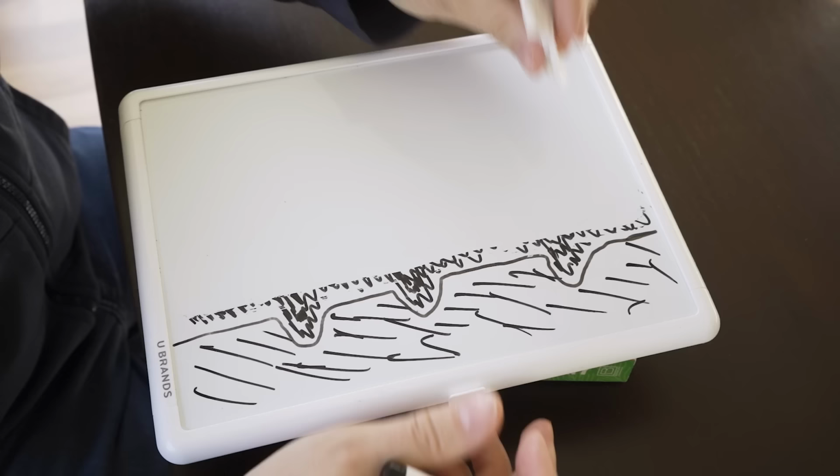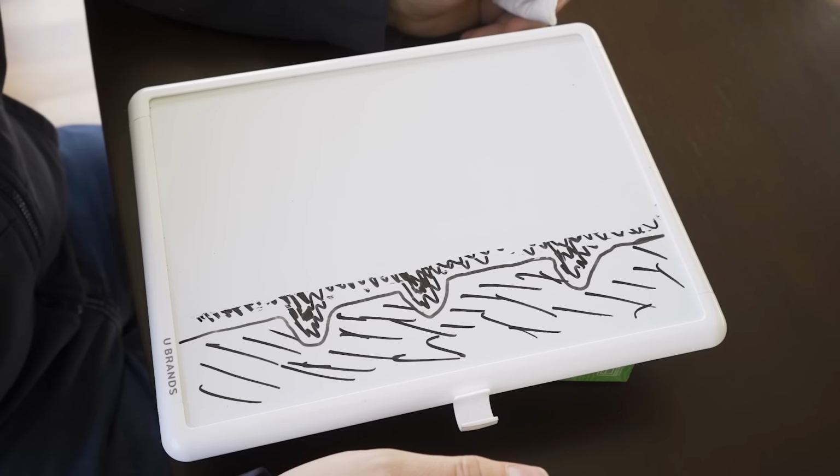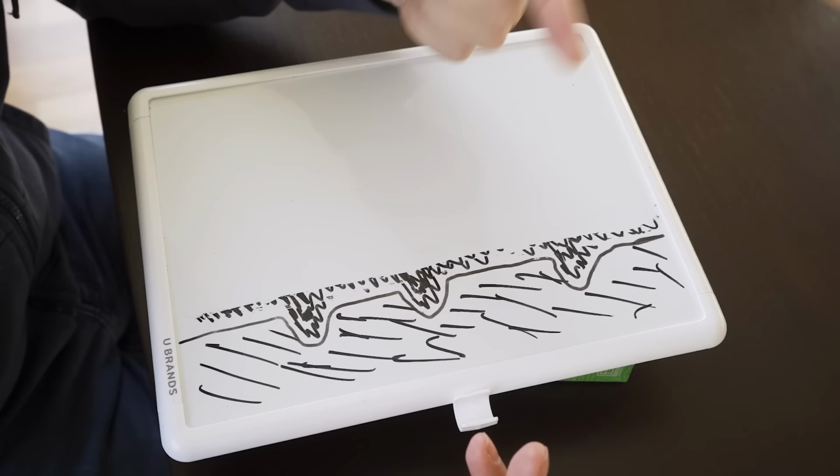So that's what I'm gonna try on this one. And I'm not gonna go for a perfect surface. I'm not gonna try to completely fill all the pores, but just a little bit so they're not quite as visible. Because I'm probably gonna use a satin finish anyway in the end. And the satin finish won't show the pores as much as a gloss would because it doesn't reflect light like a gloss finish does. And that's generally when you see the pores, is when the light reflects off of those little holes in the surface.